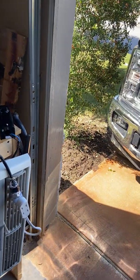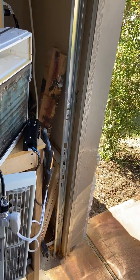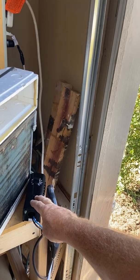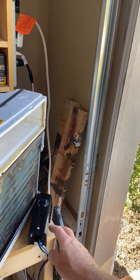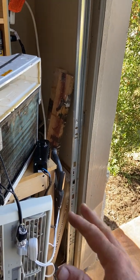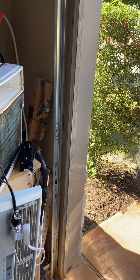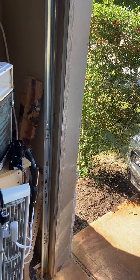So there you go — about $1.50 for the nightlight, probably three or four bucks at Home Depot. This mechanical 120-volt line-voltage thermostat was $36 from Grainger. This one covers both cool and heat, but I just tucked the heat wire back since I didn't need it. They also have a cool-only version with just blue and black wires at the same price. Total setup is about $40 to $50, and if your goal is to keep a room colder, this will work for you.